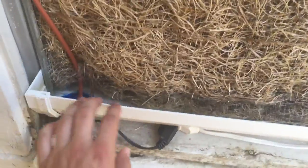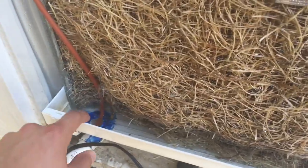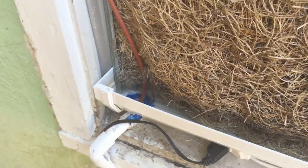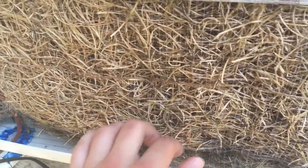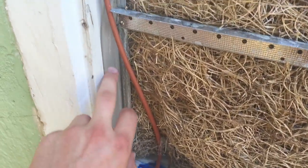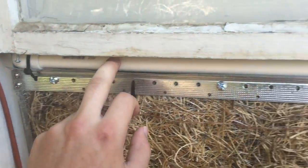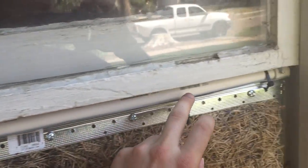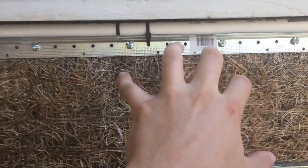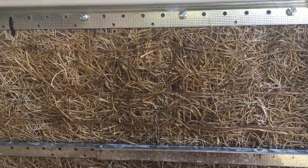The way I built this, this is a plastic rain gutter with some caps on it so it's watertight. I put a hole in the bottom to drain the water out, so it catches the water and then it drains out. Right here you can see this clear tube with water going into this top PVC pipe that's got lots of holes drilled in it all the way along it, and it evenly distributes the water along the pad.